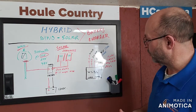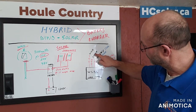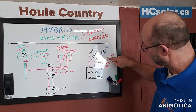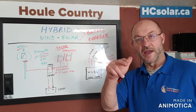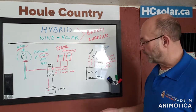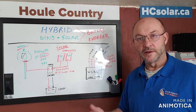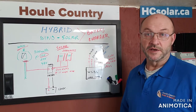To build this battery charger, we start with our little controller. We have wind energy hooked up to it, solar energy coming in, and battery output going out for 12-volt charging. There's also another circuit called a load — it runs a 12-volt street light. So if you want to throw a light outside your camper or cabin, at night when the sun goes down the controller senses that and turns on that 12-volt light. It's a very efficient way to run lighting without an inverter.